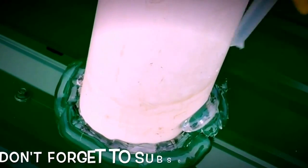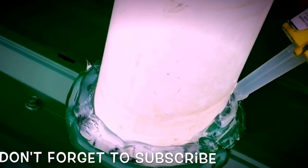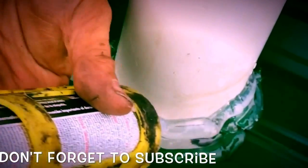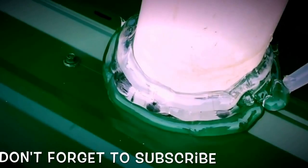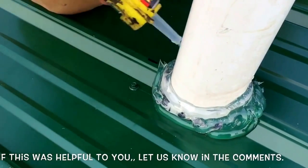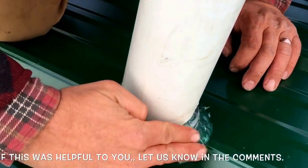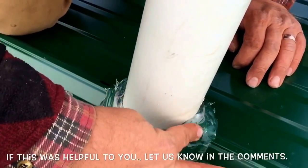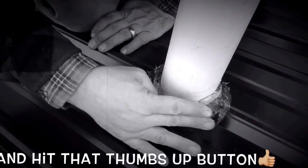You want to use plenty, and I actually call it a weld. You can see I'm kind of building on it, pyramiding against it, because remember, this is what's going to keep water out of your roof. I've never had one of these leak. It's more waterproof than the boot, and it's cheaper. You're going to absolutely love this, and it looks better from the road. It looks better from the ground.